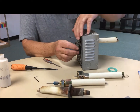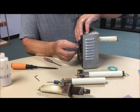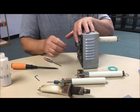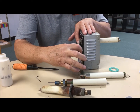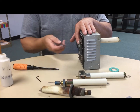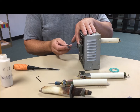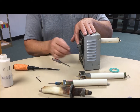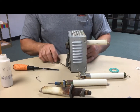So what we do is take the trigger, the weight, and the claw, and align this. There should be at least a sixteenth of an inch gap between the edge of the claw when the trigger is fully up in position. If you do that with this tool, you should be pretty good to go. Everything should be in alignment and you should get a nice 90-degree bend on your cone.